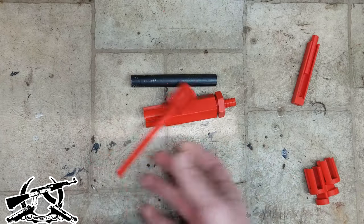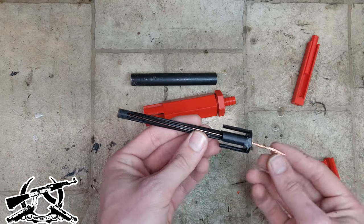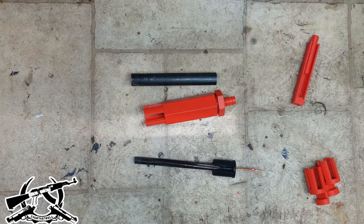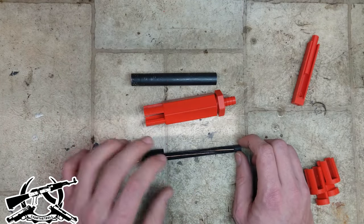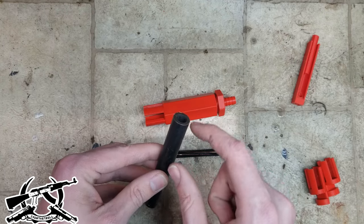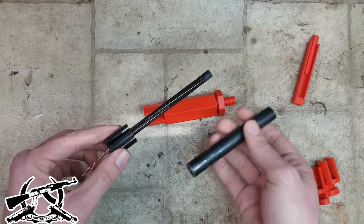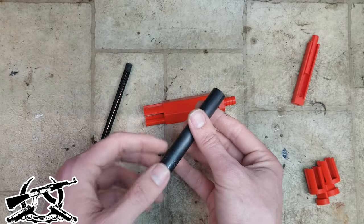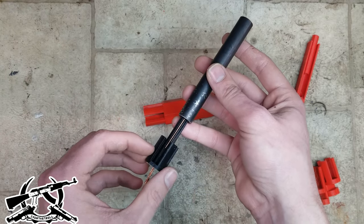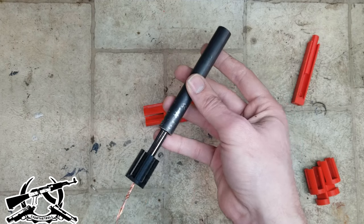You'd put five more wires in, so you'd have all six for your six grooves to cut into the barrel. That ends up being your rifling tool. This is a completed rifling mandrel — you can see it's got six wires laid into it. Putting these tools together will be slightly more complex than the boring setup, because when boring the inside of the tube is uniform with no up, down, left, or right. But once you start making rifling marks, there is an orientation. If you cut rifling for a while, take the tool out to measure, then put it back rotated even 20 degrees, your previous rifling marks won't line up with the new ones.